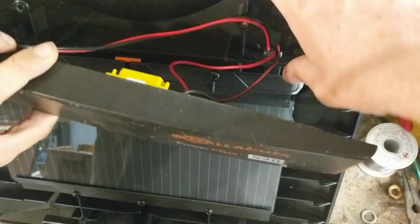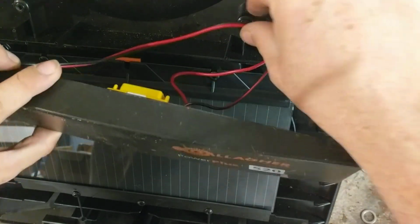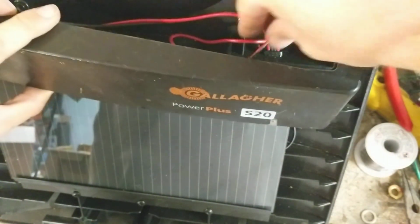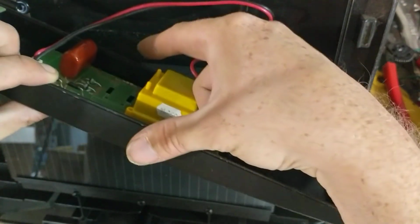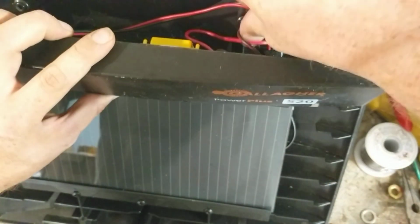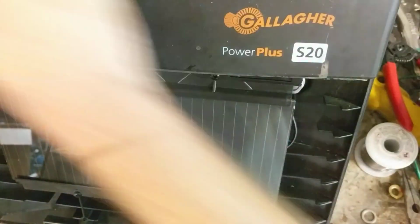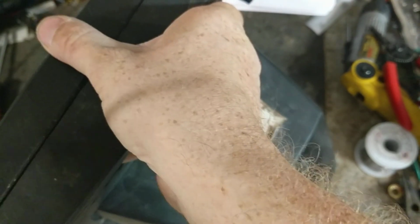tuck these wires out of the way because these little screw holes right there, you don't want the wires getting in front of it or getting pinched anywhere, because as soon as you pinch that and you put a screw through it, you chew up the wires. So I always put some above and some below. And then you got this black plastic flap thing right here on this steel that goes right there under, above this orange thing underneath this lip right here. So this goes underneath. Wires go up above and below, and then clip that back together.